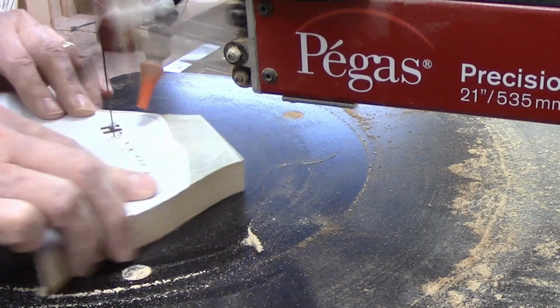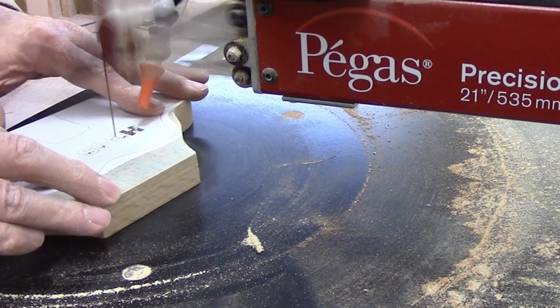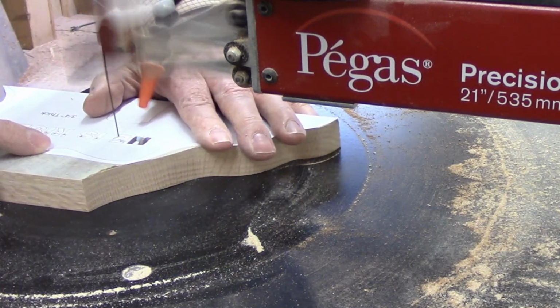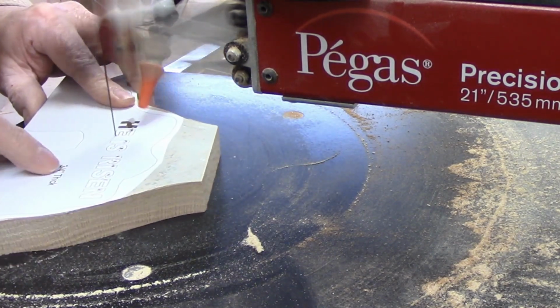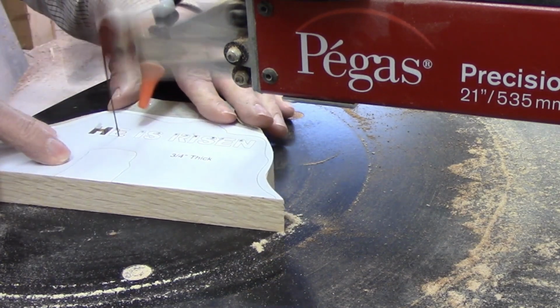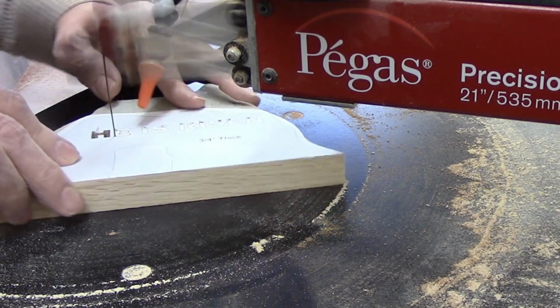The most critical cuts for this one are for the letter R. If your cut is too wide on the upright part, or if you go too far on the top part of the letter, part of the letter will fall out and it will be noticeable on the finished piece. In places where spacing is critical, like the letter R here, I try to keep my cuts just inside the cut line rather than directly on the line.